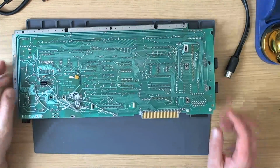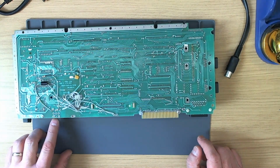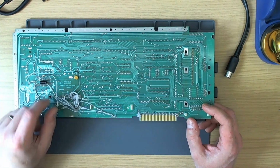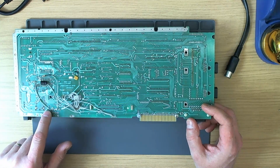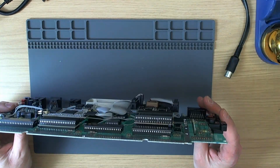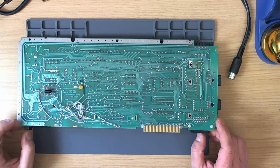So what I'm specifically interested in here is the video circuit, and I can see I've got actually a radial electrolytic capacitor on the chroma going to the video jack, which is most interesting indeed. It looks like I've replaced the video jack as well. For some reason, that's the sync signal going to the VBXE. That is obviously luma, and that seems to be going through a 75 ohm resistor. And I'm assuming this is chroma, and I've fitted a 220 microfarad electrolytic capacitor on the chroma. Now that must have been to reduce clocking or noise.